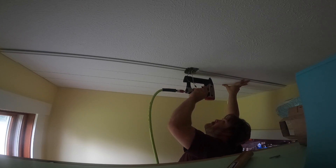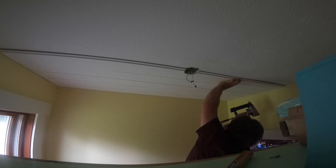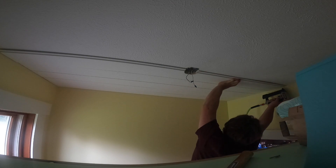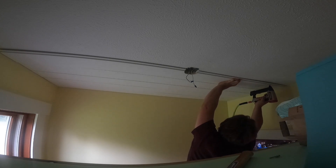You see me press them up there. Some of these are hitting studs, some aren't. I did keep them all in nice lines, in nice lines next to the board beside them. These are all going to get filled and painted, but that's just a visual thing - keeps everything neat looking. I did two in every board.